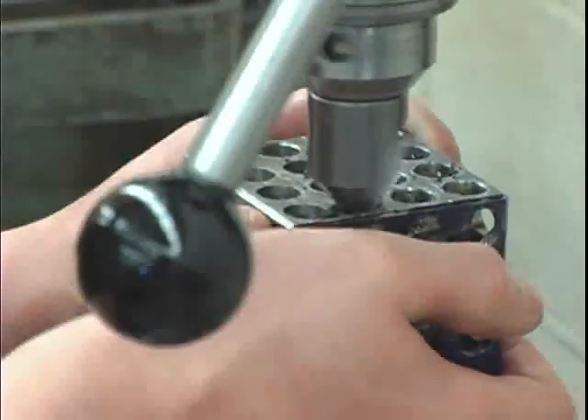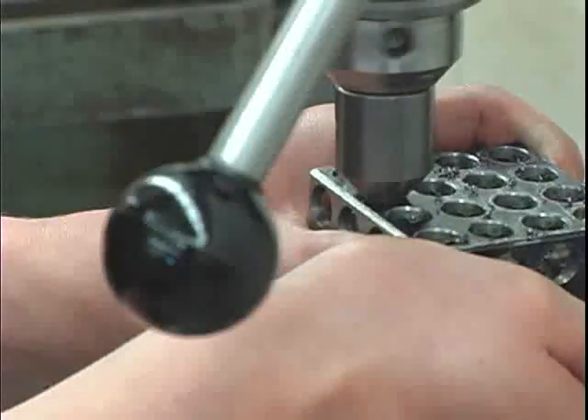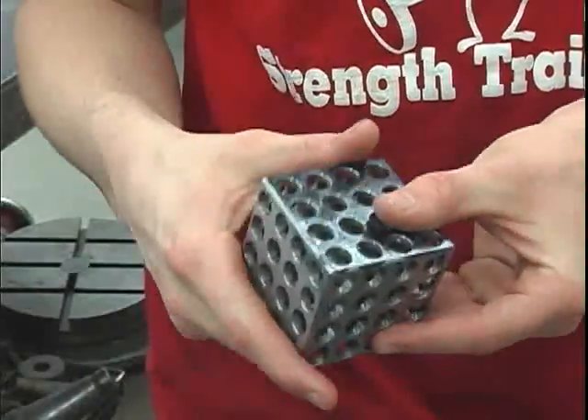After each cutting operation, it's up to the machinist to get rid of the sharp edges or burrs and make sure the work side stays smooth and flat. When the block is all drilled, it is ready to go over to the milling machine for the final boring and reaming operations, each one taking the block closer and closer to the breaking point.